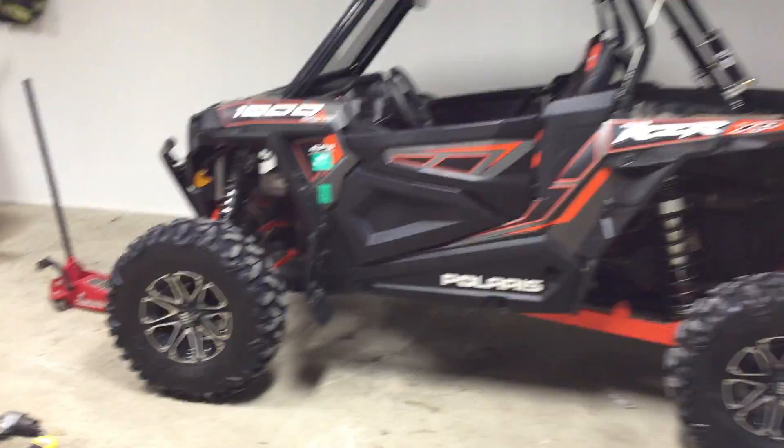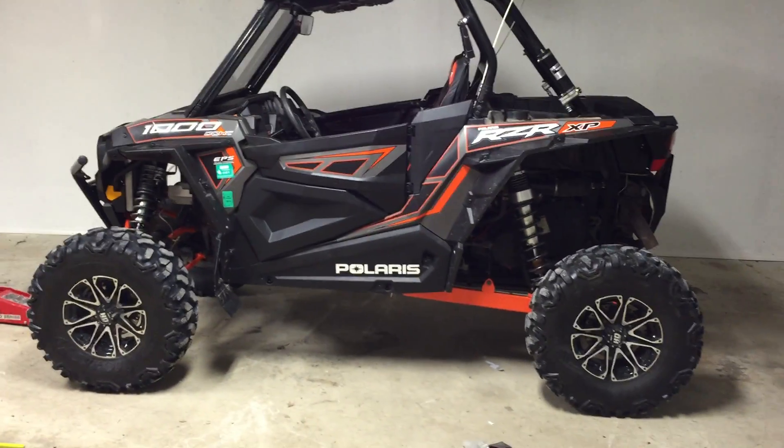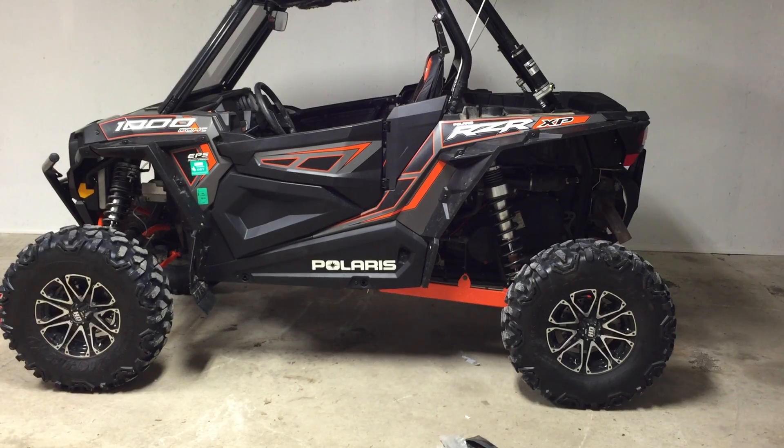The hardest part was getting that top bolt through. It's not bad, it just didn't line up quite perfect. I had to thread it through, take it out, ream it with the drill bit, and then hammer it through. That's how it sits.